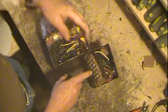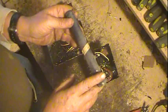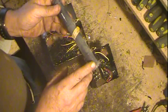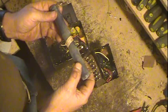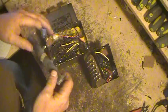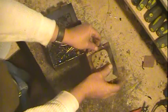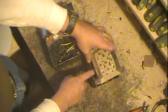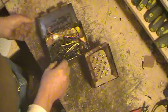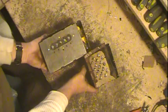And from that wire, that'll go to this big guy here at one end. There's a 775 ohm resistance, and that is the cathode resistor, the biasing resistor for the 245s. And of course this just shoots down in here. It was held in by tar originally. I'll just hot glue it, and then this snaps on like this.